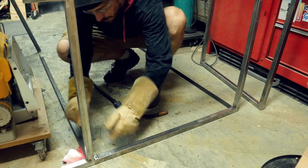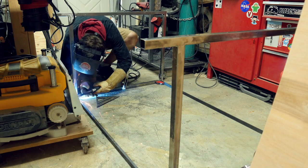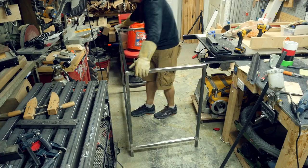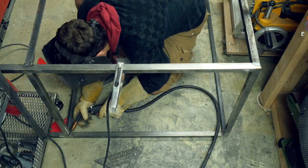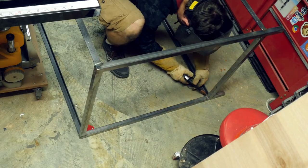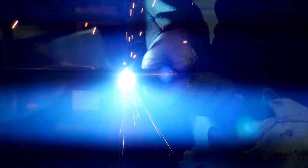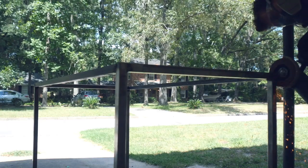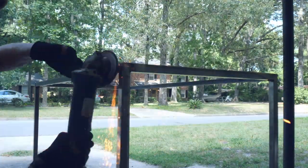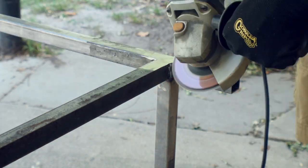I got one piece tacked in on one side, squared up the opposite one, and tacked it in as well. I tried to get all these pieces tacked together with the two frames before filling in the welds to make sure that everything was square in all the different directions. I didn't want to finish all the welds until I was sure that the frame would sit squarely on the floor and wasn't lopsided or wobbly. I finished all the welds on the inside and the outside of all the joints and then took it outside to do all the final grinding. There was quite a bit because I'm not really a very good welder, but I tried to get all the joints nice and flat.